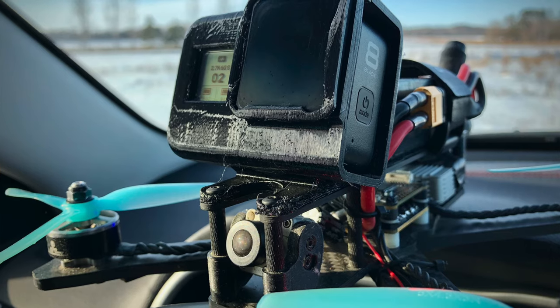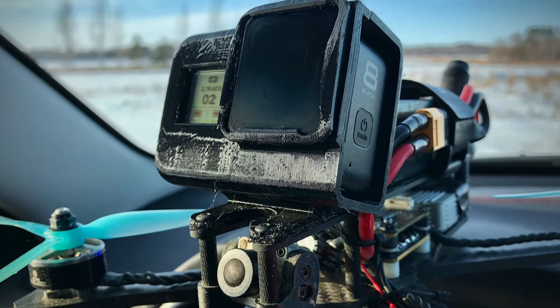As you've probably noticed, when I go flying in weather like this I choose to fly from inside my car, where I can keep the heat going and stay nice and warm. One downside is that when you bring the drone back inside from the cold, everything fogs up — moisture on your lenses, moisture on everything. That's another reason for the conformal coating. Just be aware that your GoPro lens and FPV camera lens will get a little fog or moisture on them. Usually putting it back outside in the cold clears that away, but if you crash into a snowbank and your camera sensor really gets fogged up, you might not be able to fly for a while.